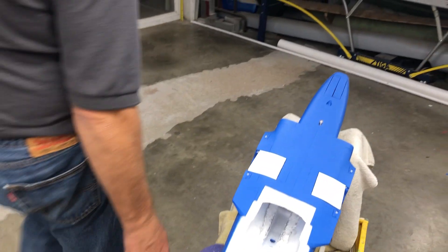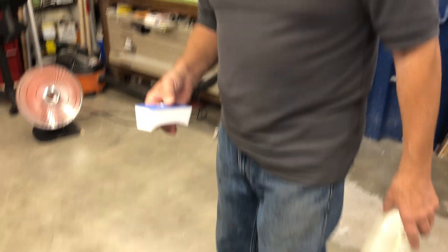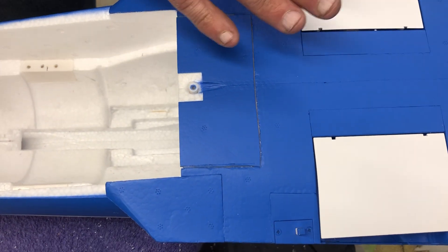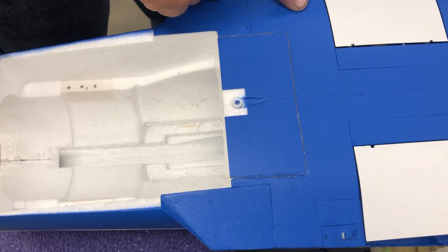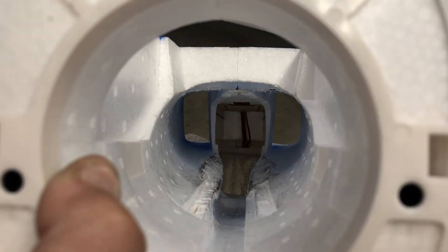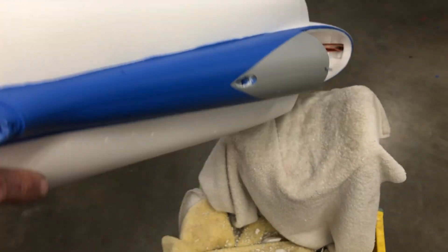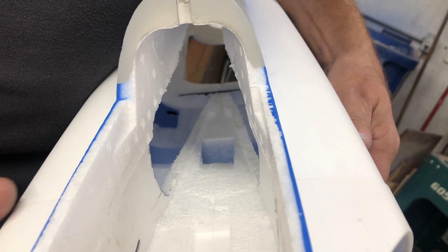It took very minimal cutting. The only part you've got to cut out is this little piece right here. I thought long and hard about cutting out the bottom but I really didn't want to — you'd have to cut through the back spar, so I tried to do it without that and I think I succeeded. Looking down the model, you pretty much just take out the V, and there is a little bit of beveling you have to do right here. I will be supplying a template of this shape so you know how to bevel it, and I'll be providing a shape for this contour up here as well.